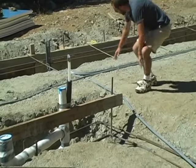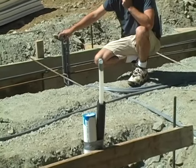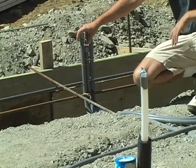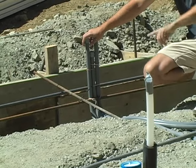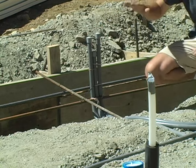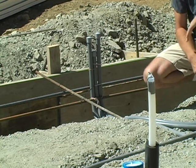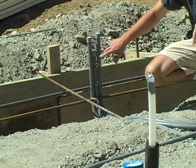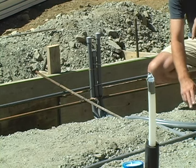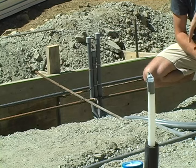We've run this all the way out and taken it to our first stop, which is a three-way electrical switch. That means we have a light switch here that powers the light in the house, and then there's a light switch on the other end of the building that also powers the same switch, so you can turn it on and off from either side of the room. We've got conduits running back over there to carry power back and forth between the two, and then a third line which runs out to power another switch on the other side, so we can tie the main line into that second line and create a secondary source at the other end of the building.